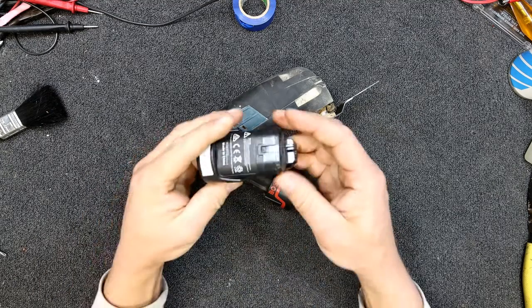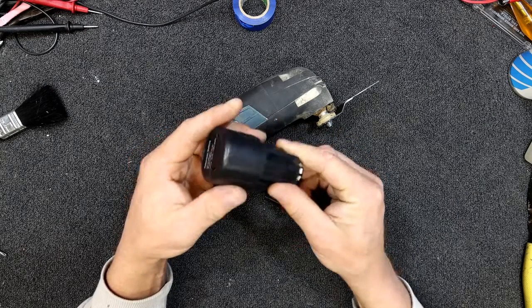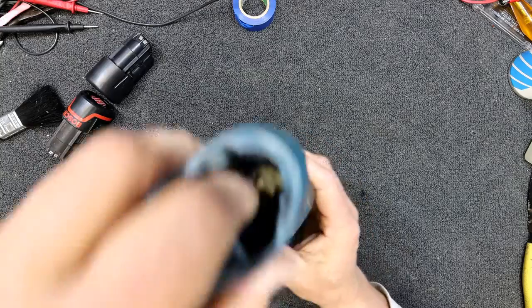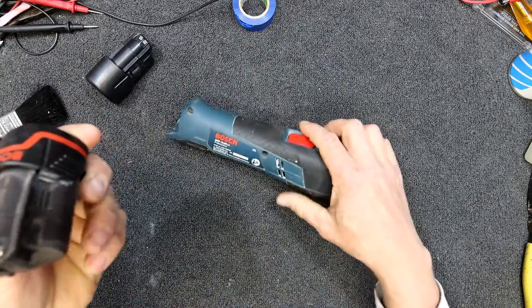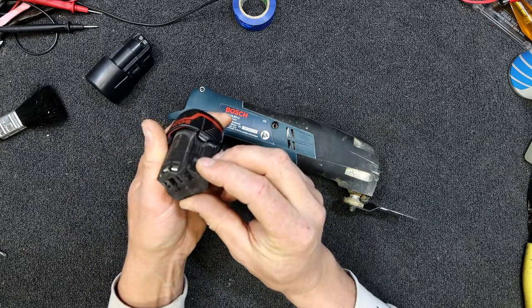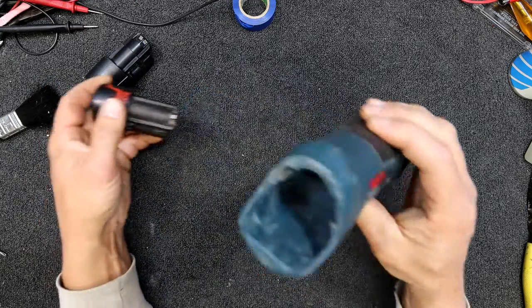And I got one of these ones off eBay. I just didn't even check it. I thought, oh, they were fairly cheap, so I ordered one, and it didn't make any difference. It didn't actually run. But what I found is there's a little sensor where this battery connector is in here. You've got two pins which go to your two main spade connectors in there, plus and minus, they're labelled, and then you've got these three little terminals on top, and one of those, I assume it must be that one labelled TLC, had a little tab in there as well.